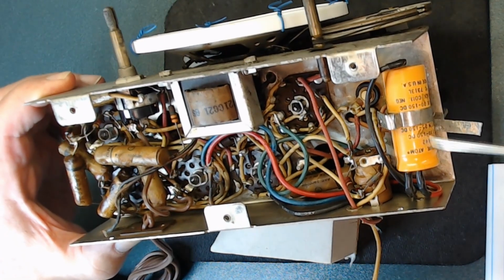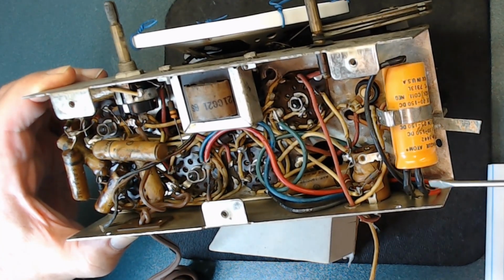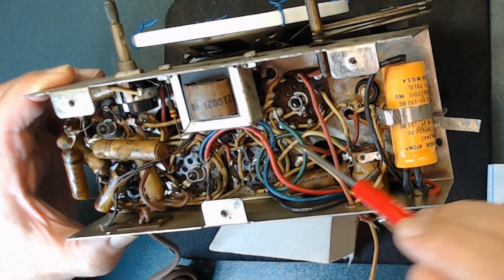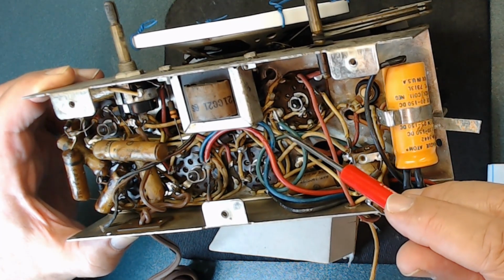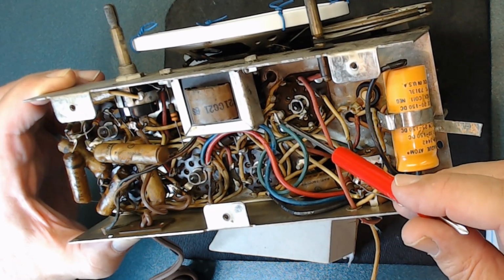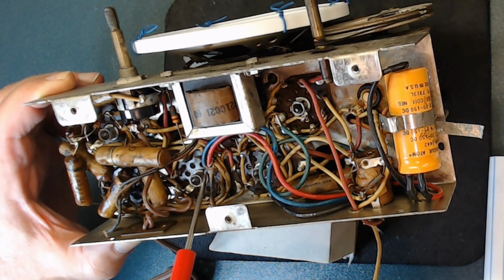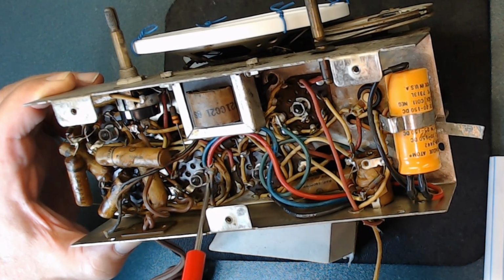This capacitor, the negative, of course, is in the back, in the bottom. There are 3 wires coming out of it. Of course, the green, it says on the capacitor, the green is 25 microfarad, which I checked in the schematic. It's supposed to be 30 microfarad. And here, there really should be just one capacitor, 50 microfarad.